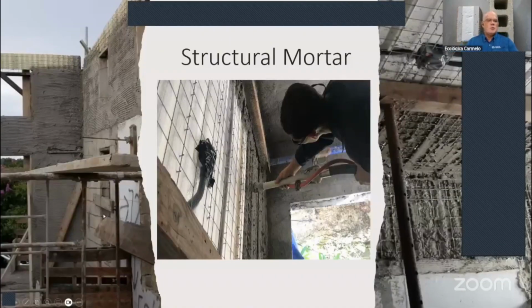So now we're ready to apply mortar, right? And let me show you. The first thing we do is spray the mortar on the walls, because we want to make those panels stiffer on the walls first. And then we do the ceiling. Make sure all those boxes are covered with tape. You cover them before you start spraying mortar.